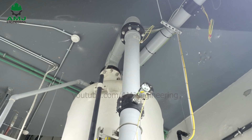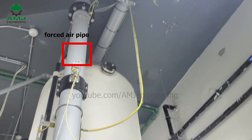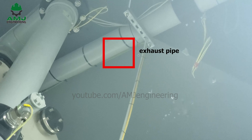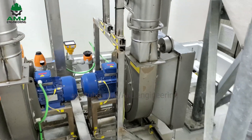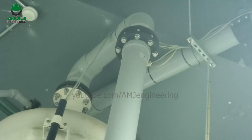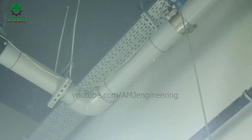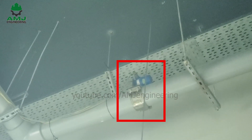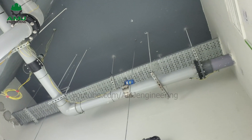The hydrogen gas disengages from the liquid phase in the upper part of the tank and is flushed with forced air to keep H₂ concentration below 1% by volume. Dilution air is provided to the tank by two centrifugal air blowers — one operating and one standby. On the outlet vent line, an air flow switch is installed for safety to stop the system in case insufficient air is flowing. Additionally, a hydrogen detector is part of the safety system and is installed on the vent line, with a set point of 1% by volume. If the detector measures a value higher than 1%, the system switches off.